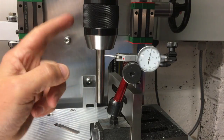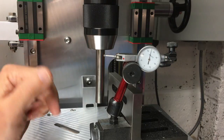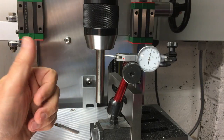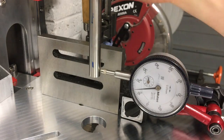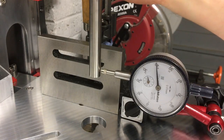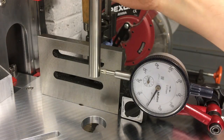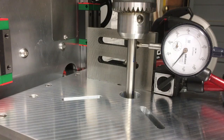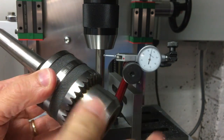I've just been doing some tests with this brand new keyless chuck, looking at the runout at the bottom of this precision ground bar and at the top. I'll show you the numbers in a minute. First I'll show you the previous chuck. This is a little bit of footage I took a while back — the runout with the old chuck, the one I've been running with this drill for quite a while.